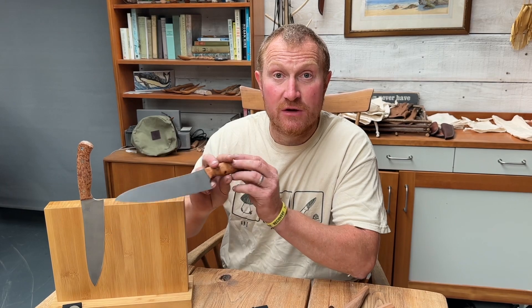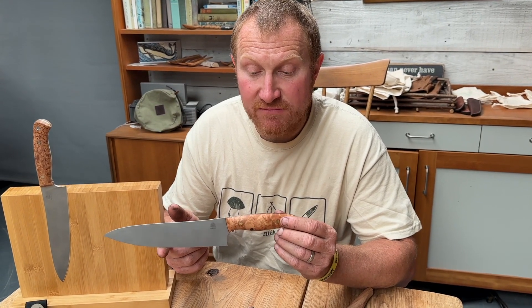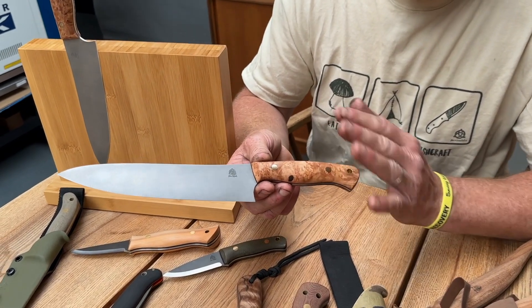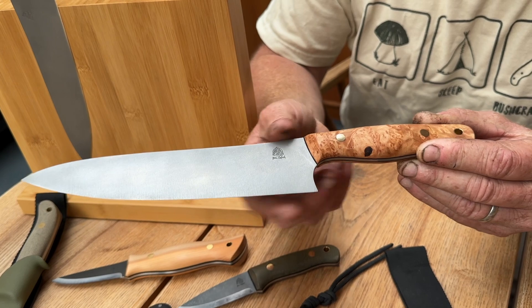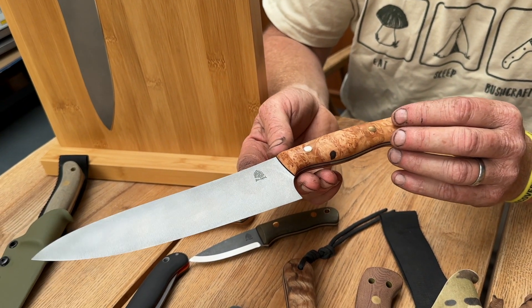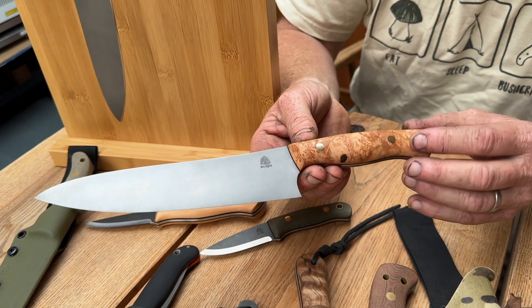The other items we're going to have available at the show - which we're pretty excited about - we've been working on them on and off over the last probably eight months, a few different designs, but we have worked on our new kitchen knife design. Lois has come up with the name 'the Provider' and we've made a couple. I've had one in the kitchen prototyping it and I've changed the grind a few times. What we've gone for now is a full flat grind with a very slight convex edge to it. These are still super duper thin and we've got some with a stonewashed finish and some that are going to have a polished finish.